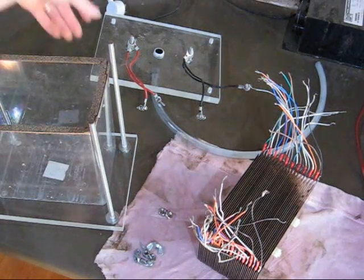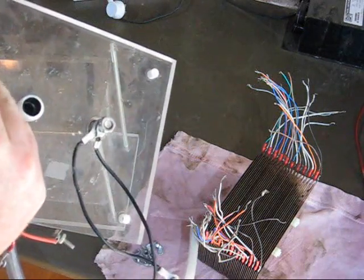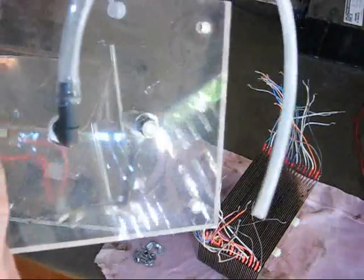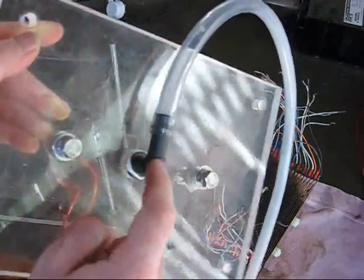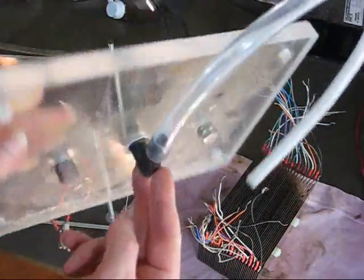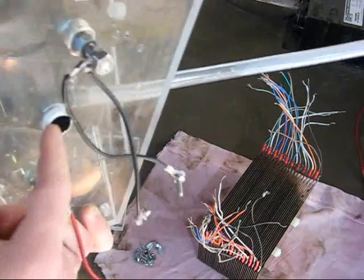They come on top here — that's the top of it. The top consists of once again a 15 millimeter acrylic plate and a couple of stainless bolts, which I have asked the shop to pre-thread for me. One, two — they will be our electrodes. They pre-threaded this hole to suit this plastic outlet, just from a plumbing shop. I've put quite a bit of Teflon plumbing tape on it and it sealed it off fantastically — I didn't need to put any epoxy or anything like that.